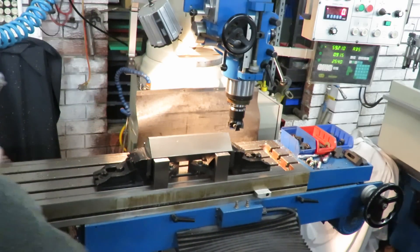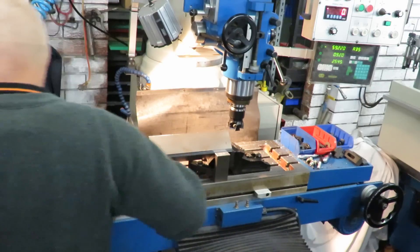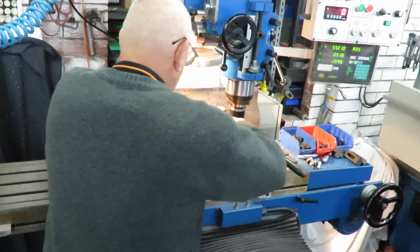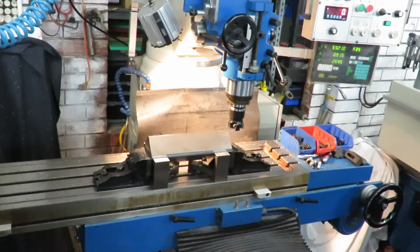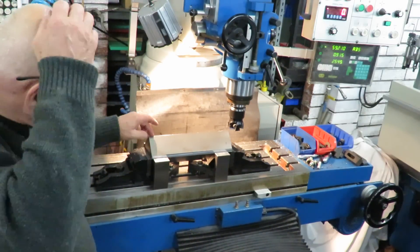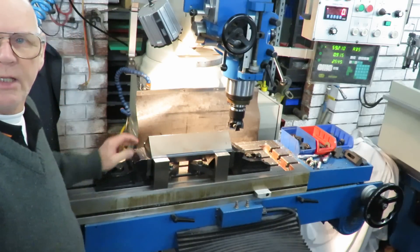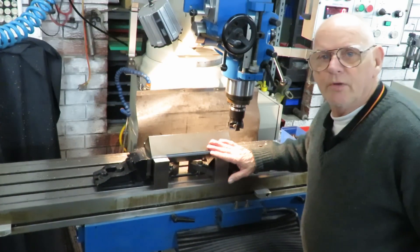Now we're going to break it open and move on to the next cut, the last cut in this series — I'm going to just roll it over. My steel supplier does an excellent job of sawing these pieces; there are 20 of these and they're cut very nicely. It will be noted that if you're looking for something very, very accurate, sometimes it pays to have that one vice a little bit free — bring it up so that it's square with the edge, and then lock it back down before closing it off. But in this case the cutting's been done very, very well.